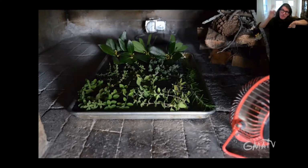You're also restraining the exhaust from coming out the door, going up the flue, and that increases the residence time of the heat, right? So you're creating swirls of all the heat flows, and that's more time that it can be in contact with the thermal mass. That's more opportunity for the thermal mass to absorb heat, and then subsequently more time to bake and cook later. Yeah, it's sometimes called a draft door. You might have your perforated door that's maybe not as heavy as the main door, but it'll allow oxygen in, exhaust out, and reflect heat back into the oven.